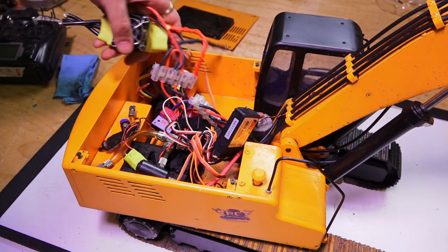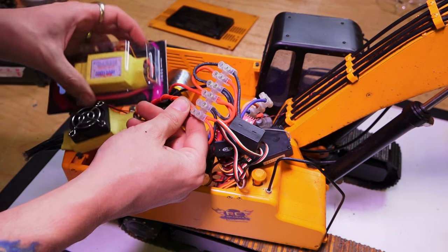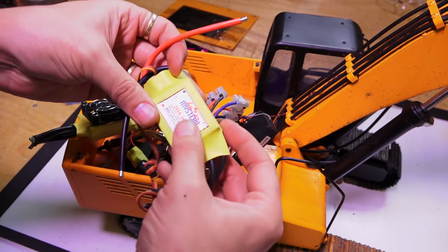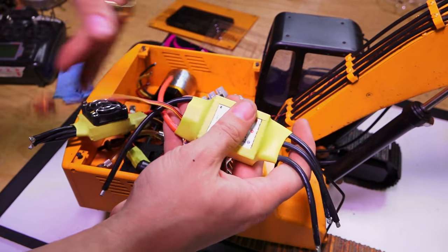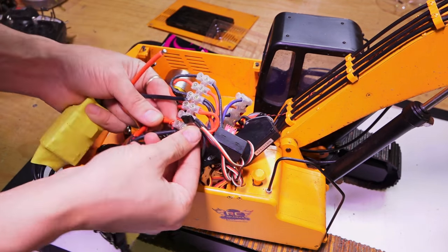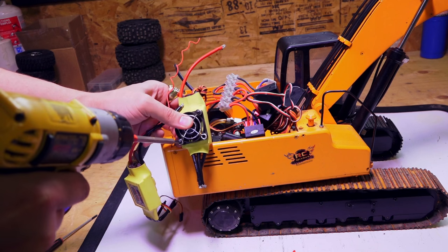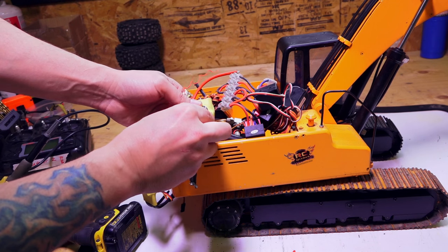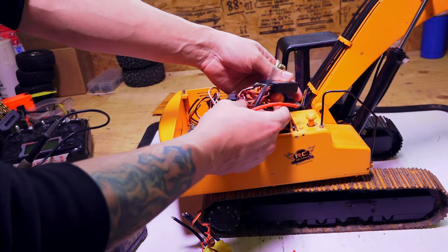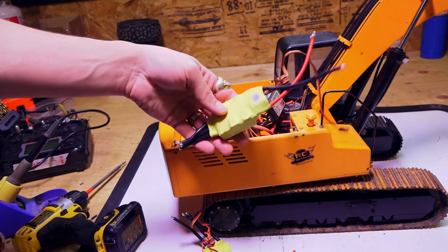ESC time for the main brushless motor. So looking at this, I'm going to have to remove it here and then basically replace it with the same one that we have here. Let me bust open the package. Mystery electronic speed control — that's the one we're using in case you're interested. Looks like they already have the ends clipped and ready to go, that's handy. And I'm going to need a Phillips screwdriver. In the receiver, of course, it has the lead for the ESC — I want to remember what plug it comes out of. Looks like it's channel five. Everything else is full, so channel five. And it's been removed.